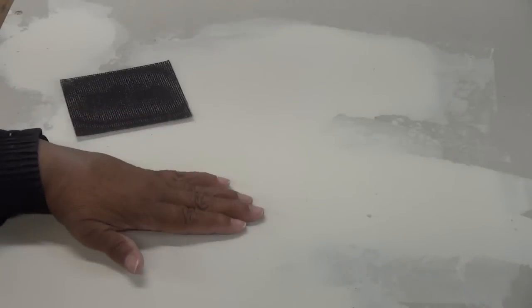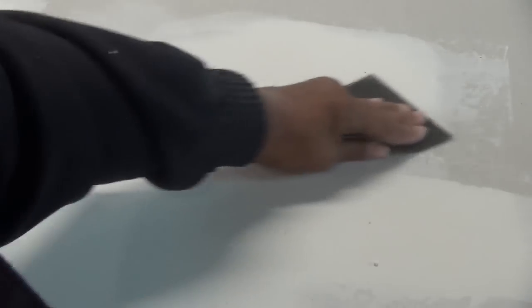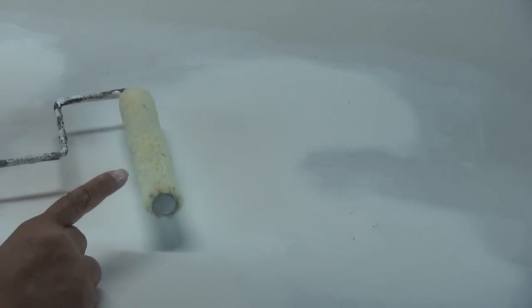The joint compound is dry. Now we're just going to do a light sand with a little sanding screen, and again, just lightly. That's all we're worried about, knocking down some of the high spots. It's all sanded. All we have to do is knock off all this dust. Now we'll apply one additional coat of the problem surface sealer, and that's what I'm going to do next. Now we've applied the sealer. We just have to wait for it to dry, and then we'll paint. So we're all done. It's nice and dry. Now we're just going to paint.